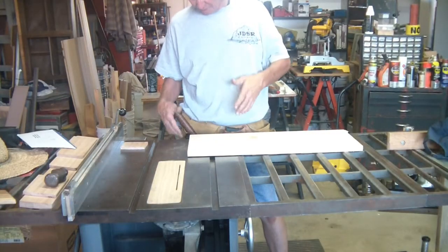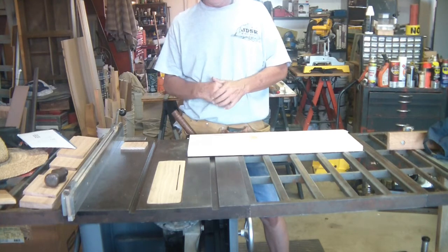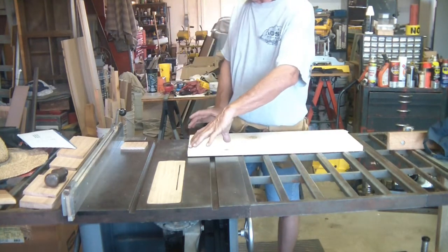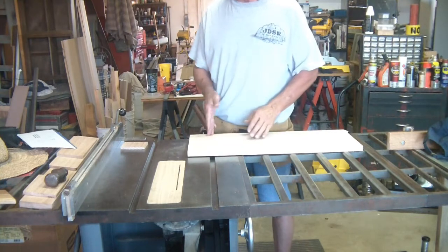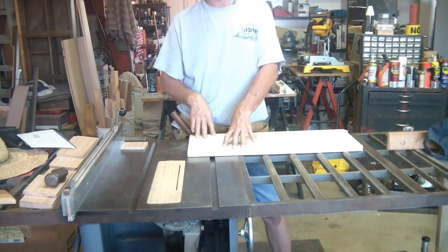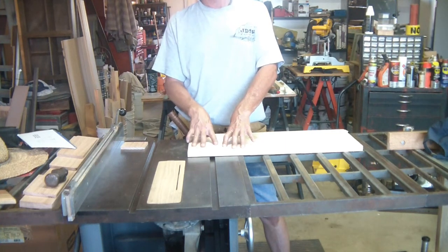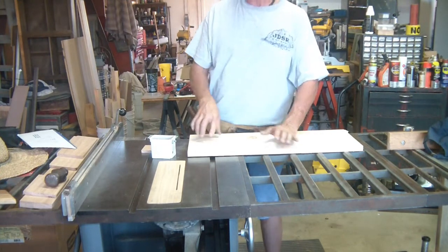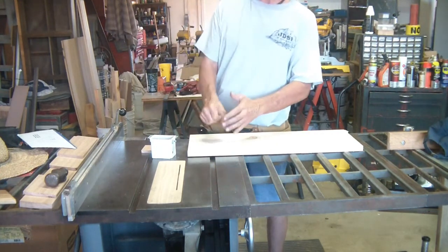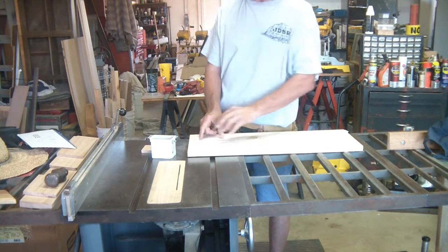With the light removed and everything, I measured where I want it to go. So what I want to do is, I'm going to cut me a 5x7 piece of wood. I'm just going to use this. I'm going to use my exterior paint for house, paint this, then I'm going to mount it up there. Then I'm going to drill a hole straight through this, through the siding, reroute that wire through this side, and this is where I'm going to mount the light fixture.